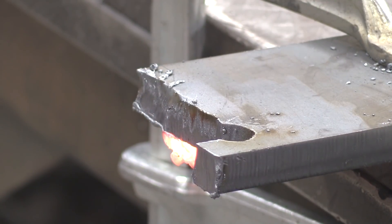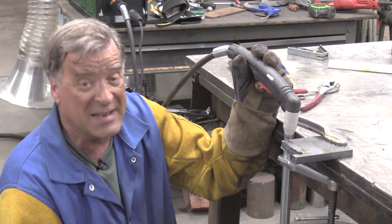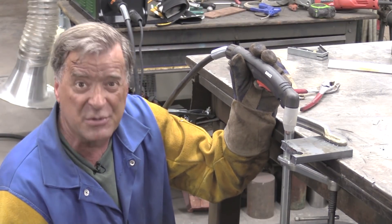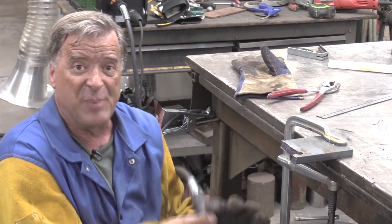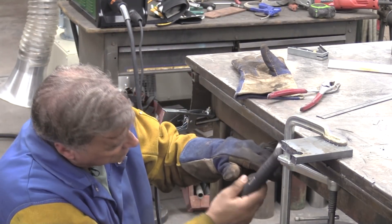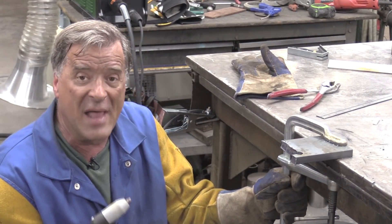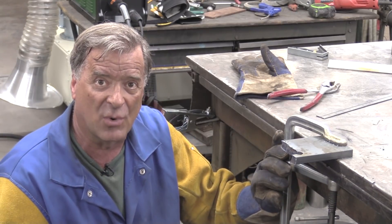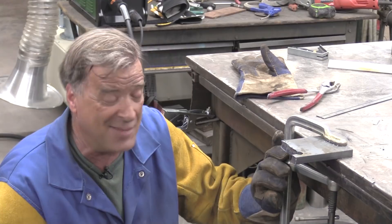Granted, it's not perfect, beautiful, smooth like the first two cuts I did where I was just almost right down touching the metal like you're supposed to be. But if you get off into some weird little spot somewhere where you're trying to sever something, cut something loose, this just lets you know you don't have to bury the tip all the way inside somewhere to get it to work. You can actually stand off a half an inch and still get the job done.